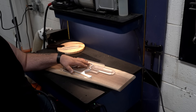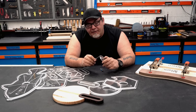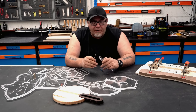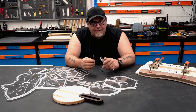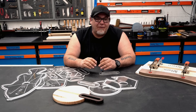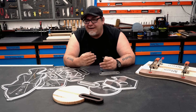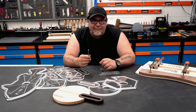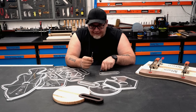Using a vacuum with templates is very handy and you can make your own vacuum templates at home as well. Earlier I said thicker is better — the reason is you can move that bearing up and down the template. You're not stuck in just an eighth or quarter inch area; you've got a full three-eighths of an inch to play with. That gives you the opportunity to get a fresh edge on the top or bottom of the material where it's most likely to tear out, so you get a little more life out of your bit before you have to sharpen it.